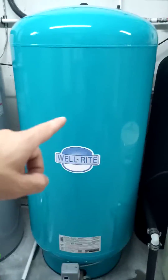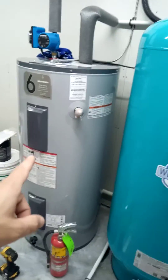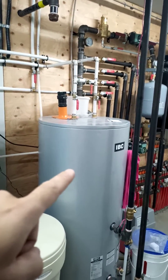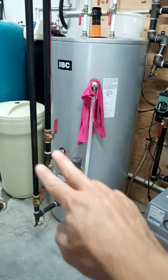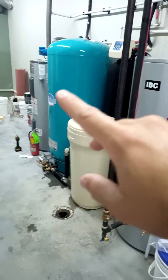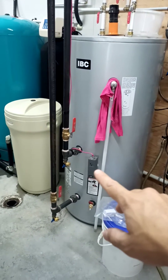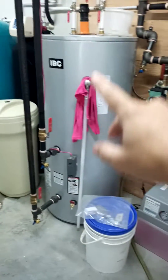First there's a large pressure tank so the well pump doesn't kick on and off all the time. That goes into here and comes out over — I can actually shut off each tank and isolate it. This tank is an indirect water heater; you can see there are glycol lines coming in, powered from my boiler. Whenever possible I don't want to use propane, so the electric hot water heater is doing all the load, recirculating into there. I have that thermostat set at about 135 and that one set at 150, so it's always dumping the hotter water into the indirect tank.